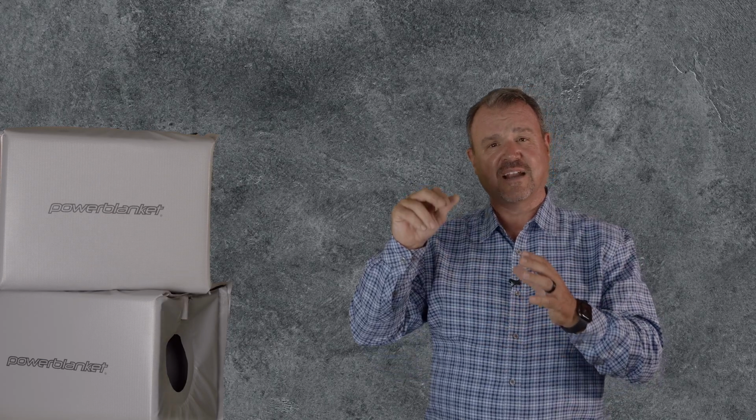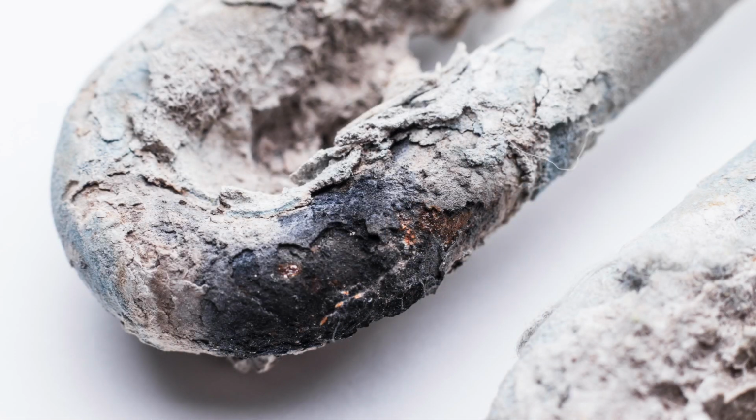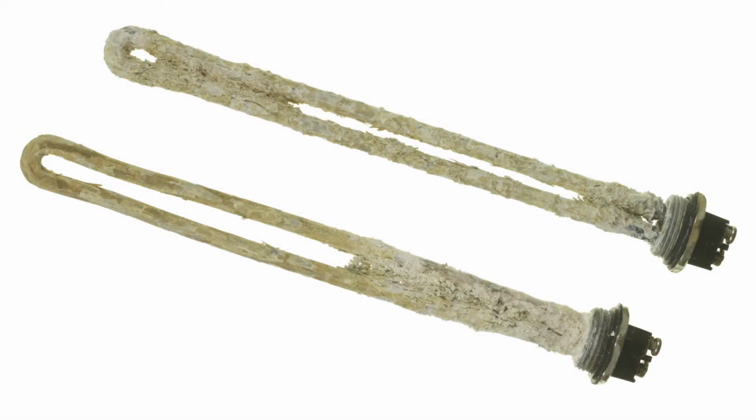Heating elements, like any mechanical device, lose about 5% of their performance every 5 years. Sometimes when other things come into play, they'll go faster or slower. I've seen electric heaters in process for over 30 years, but I've seen some that have gone out in 1 year. Electric process heaters can get attacked by corrosives because the heating element itself is the hottest portion of the process. The hottest portion is always the part that gets attacked first. So corrosion is a big issue with electric heaters, and you can't always see corrosion in electric process heaters. It occurs inside of the process. So a great preventative maintenance program over time, where you pull that heater out of process and actually take a look at it, is going to help you understand if you've lost elements or if you're having any corrosion issues.